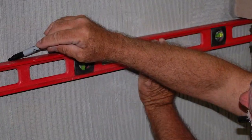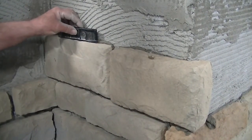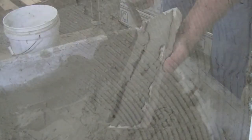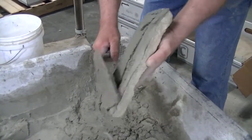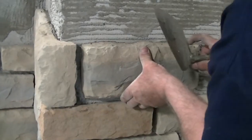Use a 4-foot level to keep lines and stones level. Be sure to step back and review your work occasionally — this will allow you to be sure the effect is looking like you intended. Once your wall surface is prepared, you're ready for your scratch coat of mortar. Follow recommended guidelines to mix the mortar. For more detailed information on mortar techniques, visit the Mortar Techniques section of this video series. Begin by applying approximately one-half inch of mortar as the scratch coat to the prepared wall surface.